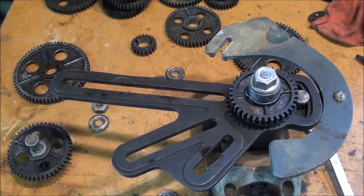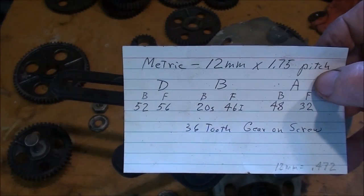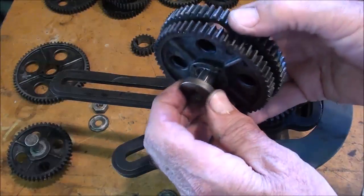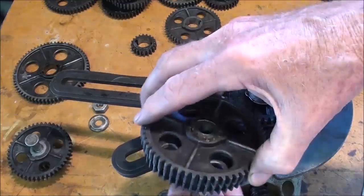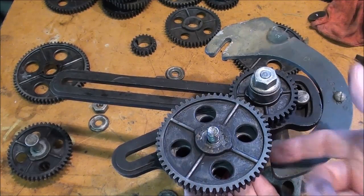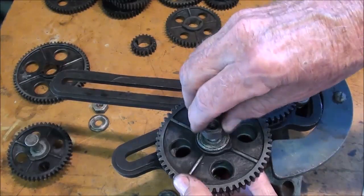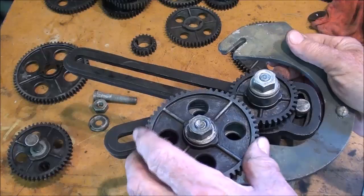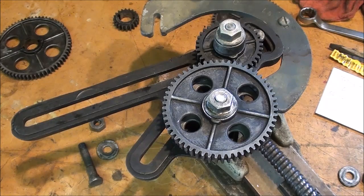In position D, which is this slot, it's a 52 in the back and a 56 in the front. There's the 52, there's the 56, and that's the way it goes on. There's already a bushing in there and I oiled that lightly. T-bolt up through the bottom — it's engaged on the gear on the bottom. I'll use the paper method shown in the other videos to set the gear clearance between the two gears. All is well so far.